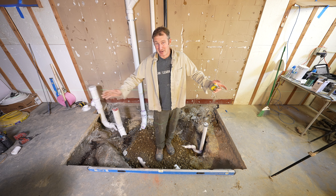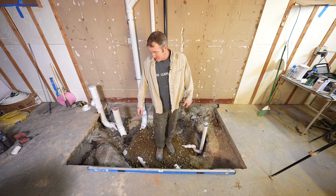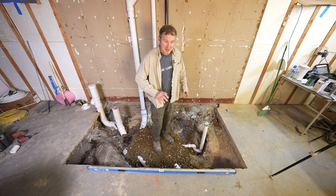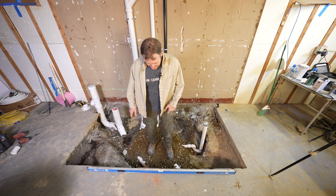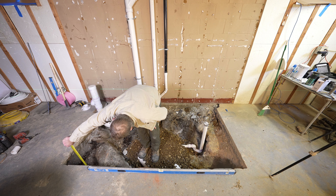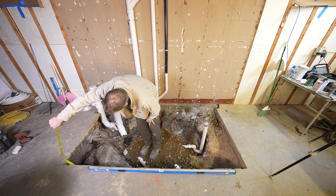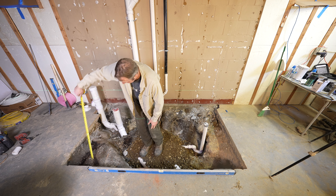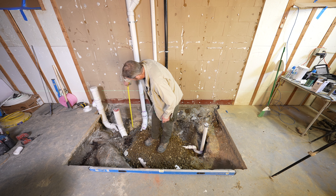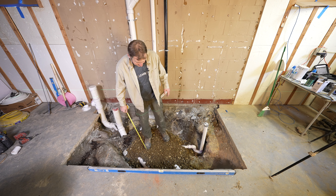This is all variable — if you have three and a half inches of concrete that's fine, though more is more stable. You need high-strength concrete underneath all of this. My biggest goal is to make sure I have a good enough slope toward the shower drain. We're referencing off this side at seven and a half inches. Looking at my laser, that is seven and a half right here — so if we get all this gravel to about 21 and a quarter, we'll be exactly where we need it.